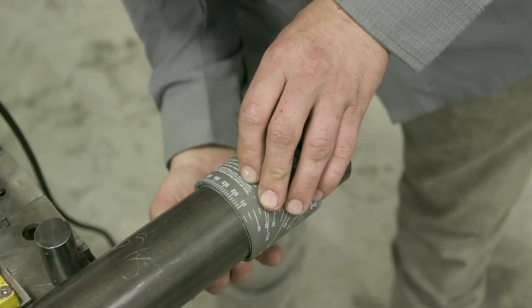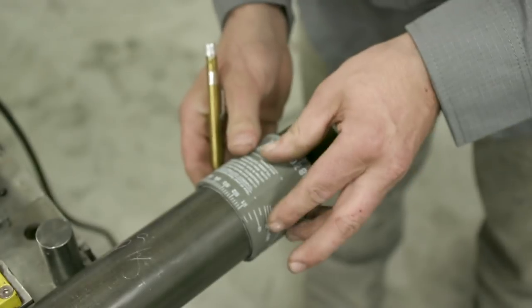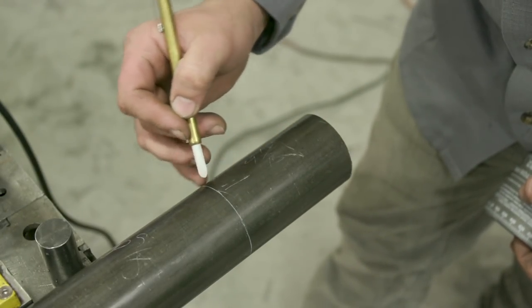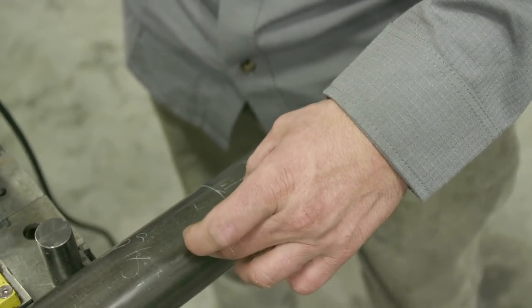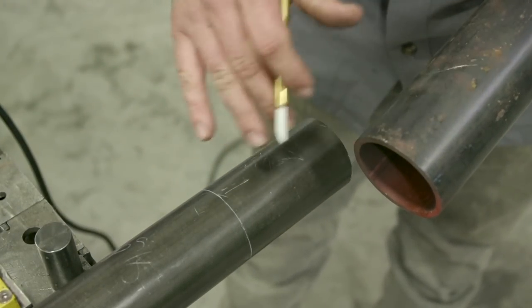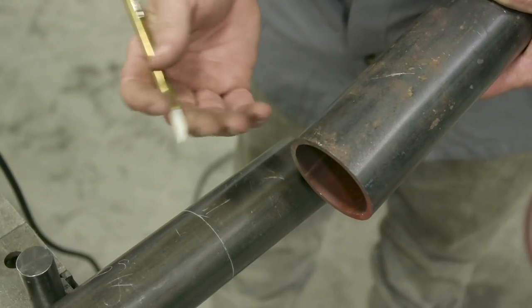The reason I'm putting a line on is because I know I want to remove mill scale right here. So we're going to grind about an inch back here and an inch back over here — clean this mill scale off because this pipe is sliding inside, and that's a four and sixteenth. Then we're going to take this other pipe — we don't have to draw a line, we're just going to clean the mill scale and get some of this rust off about an inch back.